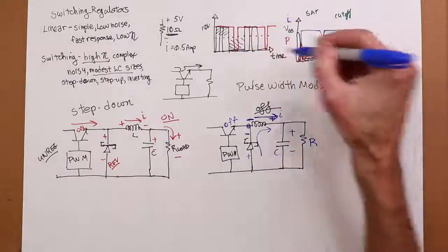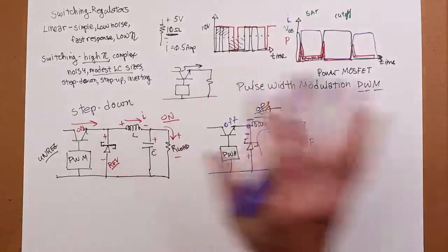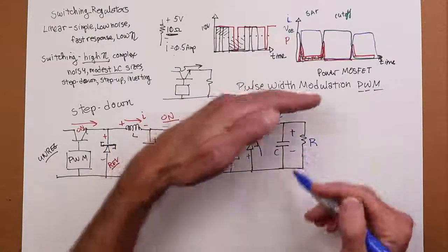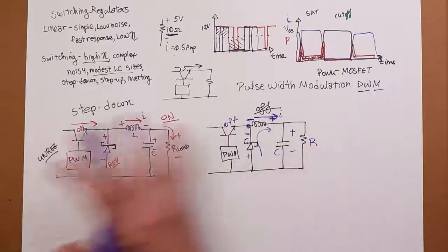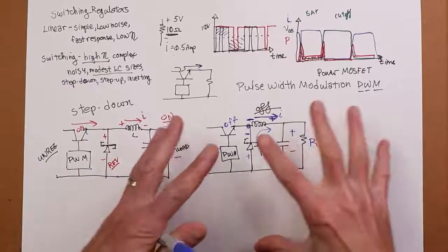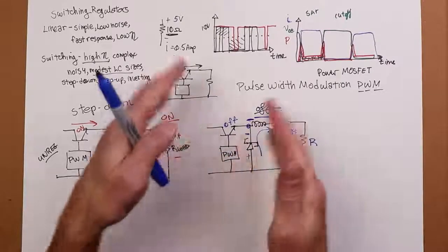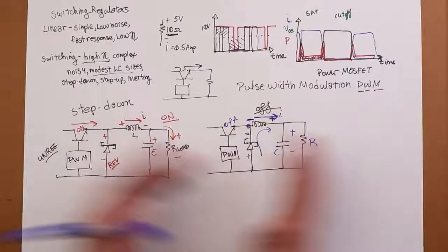And basically what we're doing is, like I said initially, we're filling this pulse energy over into the valley, right? The mountaintop goes into the valley. And then the process repeats. So as this voltage droops down, the signal is fed back to the controller, which turns the transistor back on, current floods back in, and we build up the charge, filling the reservoir, if you will, on the inductor. And then that will start to rise a little bit, and it turns off the controller. So we go from the red to the blue, to the red, to the blue, back and forth, back and forth.